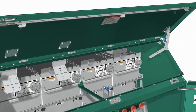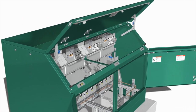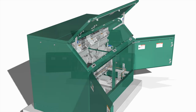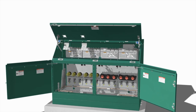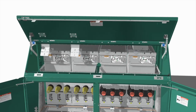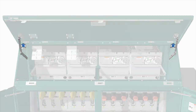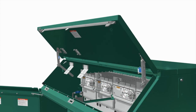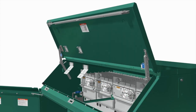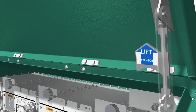If you will be pulling cables, the hinged roof can be placed in a more vertical position to allow better access to the switchgear. You will need 2 people to lift the roof, which should be done before the roof counterweights are installed. While pushing up slightly on the hinged roof, release the latches on the hold open mechanism on both sides of the switchgear. Lift the hinged roof to the second, more vertical position. The hold open mechanism will automatically engage.